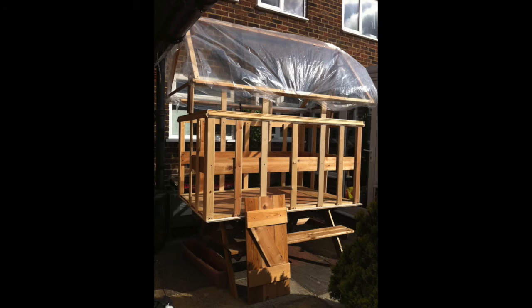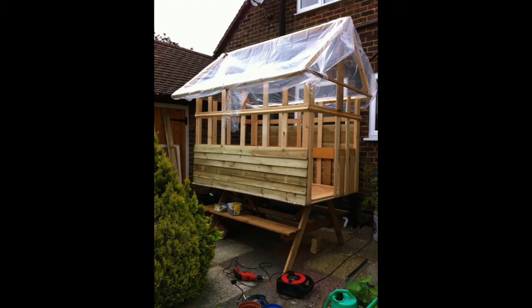Here's a different view of the same stage and you can see I've just built a little door to go on it. This is the first stage of the weatherboarding. These weatherboard strips are really quite cheap and quite long, and you can just cut them quickly to fit the length you want. You just overlap them and work your way up the edge of the building. You can leave gaps where the windows are going to be — really quick to do this stage.